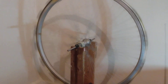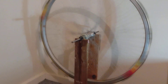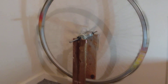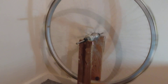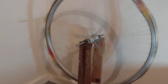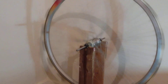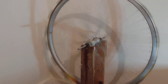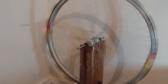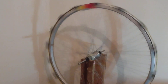I've got 16 magnets on the rotor. What I've done is I've got ceramic bearings on it as well — ceramic bearings are attached to the frame. I've used an 8mm x 300mm bar bolt. And what I've done is I've used sealed bearings, because I threw away the bike bearings because they're crap. I've sealed the bearings inside properly so they don't move, so it moves with the wheel. You get much more of a truer rotation and you don't get any wobble.